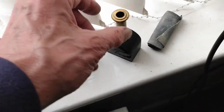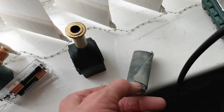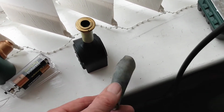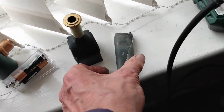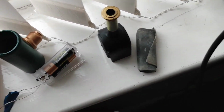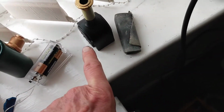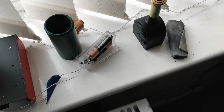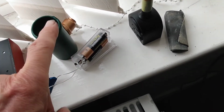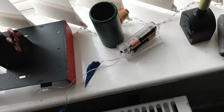And you restrict yourself with the smoke box when you put some weight in it. That's just a piece of lead. I've got enough of this to last me the rest of my lifetime, just scrap lead from flashing. I've realised I need to push it well into the smoke box to get the weight as far forward as possible. I had it just inside the boiler, and the weight isn't forward enough.